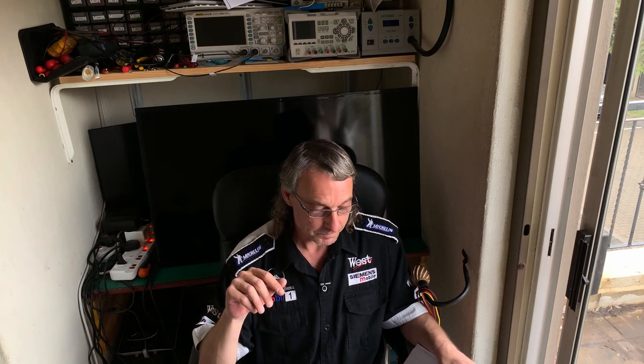All it is, it's the same LED as the 3528, just a higher efficiency. The color temperature is roughly about 6,000 K, which is what we want ideally for a TV backlight. It's a nice white, bright white to blue white, if that makes sense. You can look it up on Google.